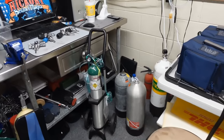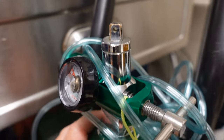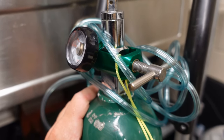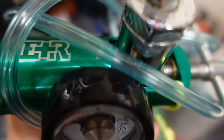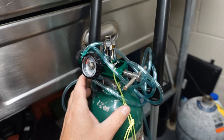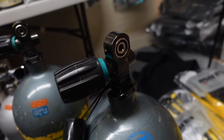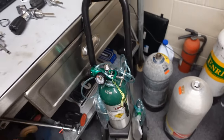To where if we go over to this oxygen bottle here, one of the things you'll notice is the valve is a little bit different. This is what's called a pillar valve. Unlike in scuba where we had J valves and K valves, this is actually a pillar valve — and I'm going to show you a different example of one shortly. If we also notice, it is still an A-clamp style system as far as how the regulator is attached, but it's a different orifice — specifically engineered and designed for oxygen use, not scuba use.